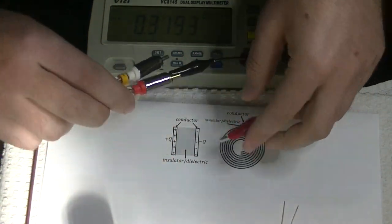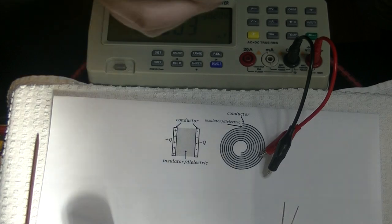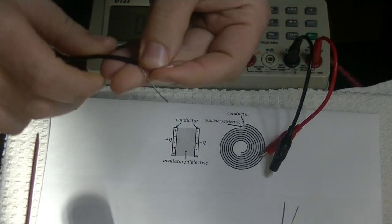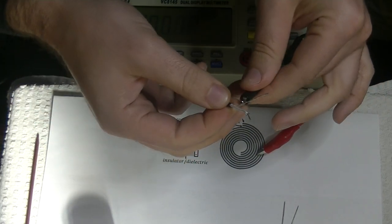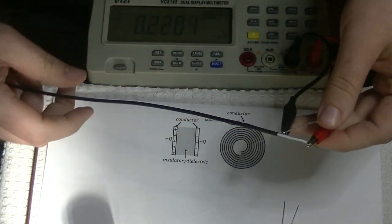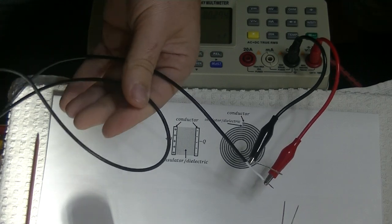Okay, what's next? So after that, we've got a great example of the type of cable that we use in our kit amplifiers. This is our shielded signal cable, and what do we like to use this for? Well, whenever we're moving the signal around inside the amp, near a noisy part of the amp, we'll put shielded cable in instead of standard hookup wire. I would say maybe about half the time that we move the signal around, we do use shielded cable.